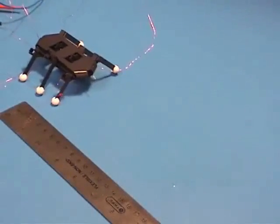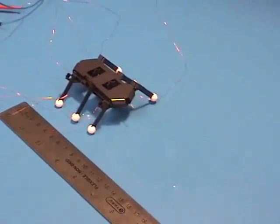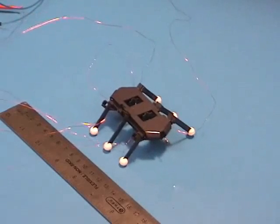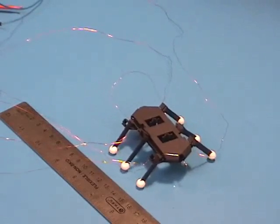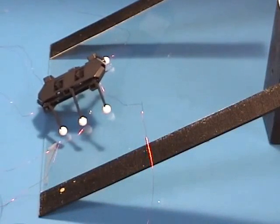Next, we demonstrate the robot walking at approximately 1 cm per second. The spherical feet are fabricated from PDMS and fitted to the ends of the legs elastically. The robot is actuated using shape memory alloy wire, or wire that contracts when heated. Heat is applied by passing a current through the wire. The robot is controlled by issuing commands from a laptop over a serial connection.